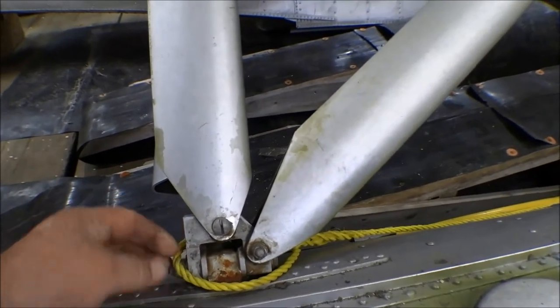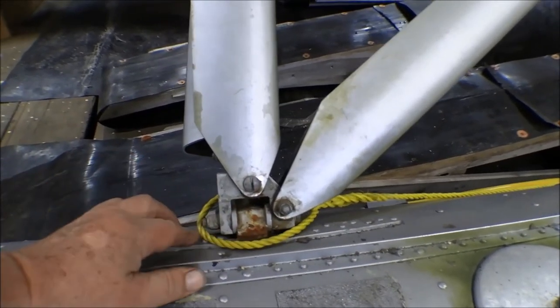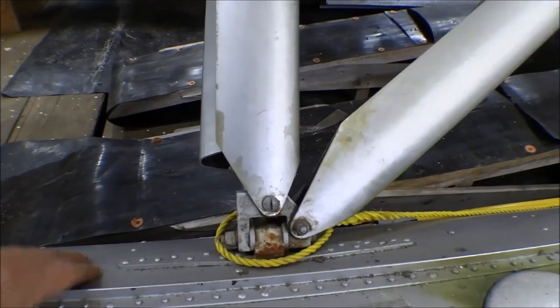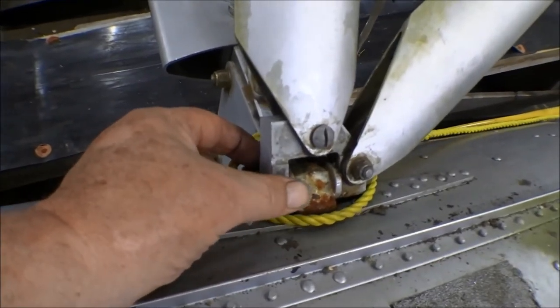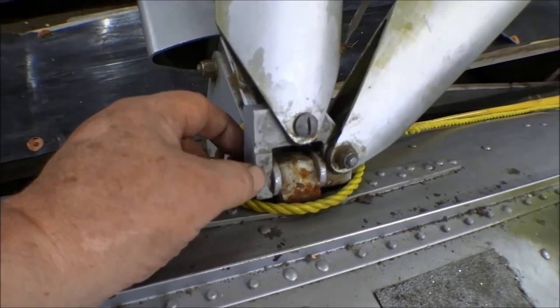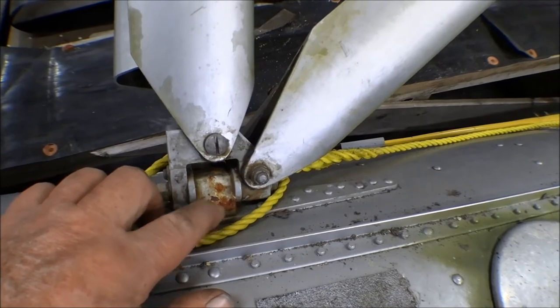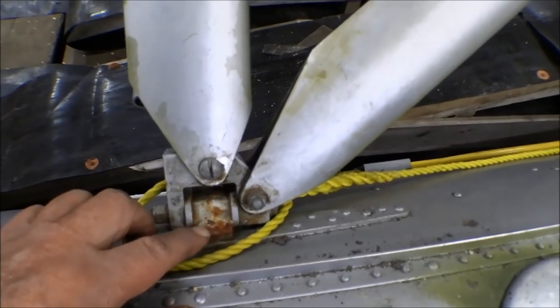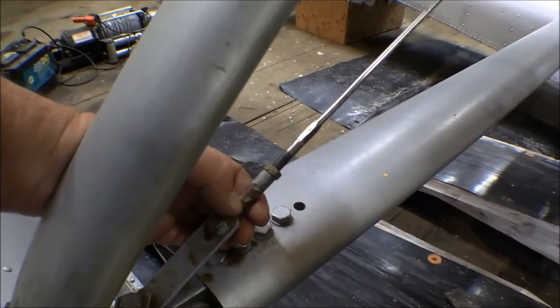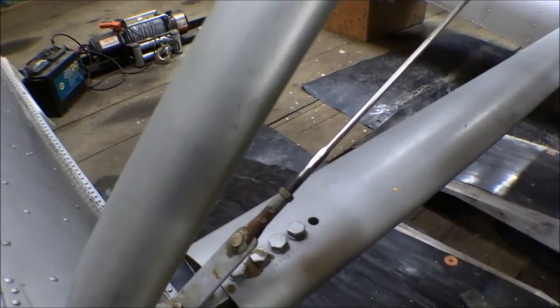Here on the back, these don't generally go as bad. They still go, because if you leave the bolts in too long they'll start swelling up and you can't get them out. Then you start getting intergranular corrosion — you can see that because these things will swell up when they start corroding. This bolt here goes down through the float and is showing a little bit of rust, but it's a big heavy bolt, about a $500 bolt, and it's still in good shape. I've got these two turnbuckles back here; they're not as bad as they look. That one's showing a little bit of rust, but I'll probably think about changing those next year — good for this year so far.